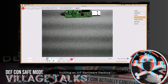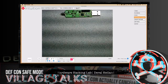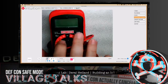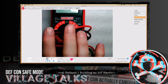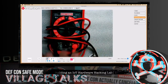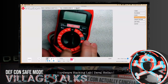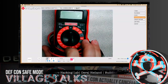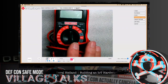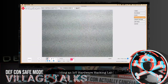Another critical tool — a multimeter. Literally, I don't think there's any engagement or any device I tore apart where I didn't use a multimeter. These are cheap; you don't need an expensive one. I mostly use it on the continuity setting for tracing out runs on boards. I also use it for checking voltages prior to hooking things up, to make sure I'm matching voltages correctly — that can really screw things up if you get it wrong.